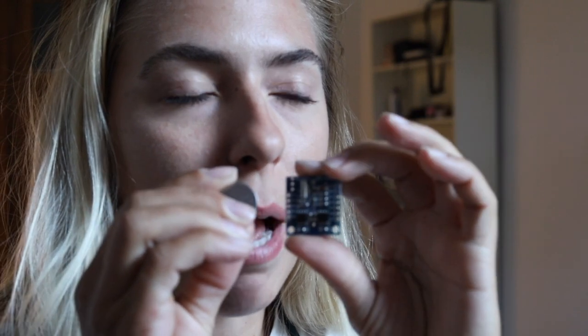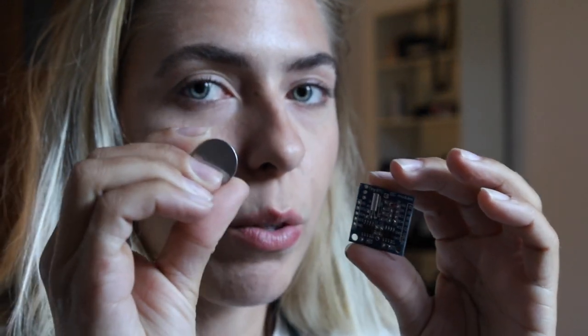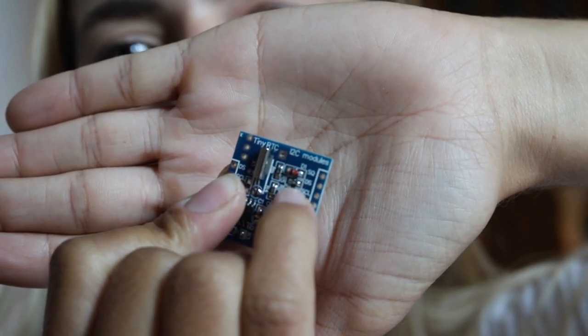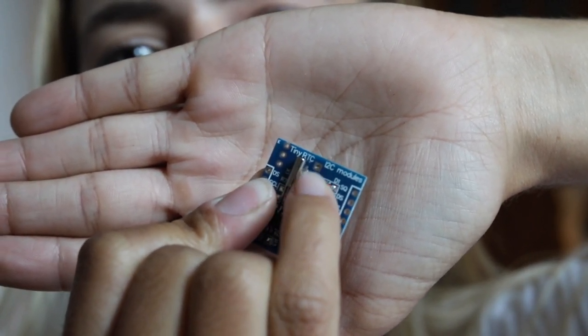So I have been reading, first of all, how to connect this to my Arduino, which I will tell you, and then you tell me if it's wrong and tell me how to do it the right way, and how to modify this thing so that it doesn't send a charge to the battery, so that I can use a regular, non-rechargeable battery with this thing. Apparently what I'm supposed to do is cut this diode here and both of these resistors and then short this resistor right here. Don't ask me why, it's just how the circuit diagram works out in all of these online forums.